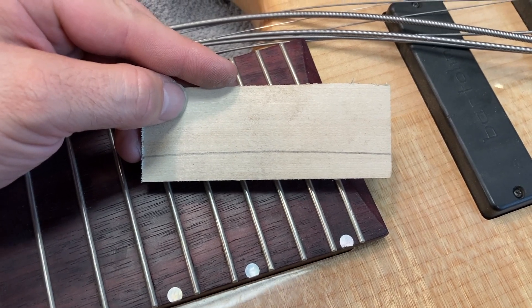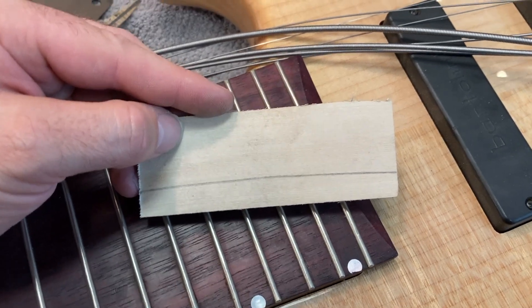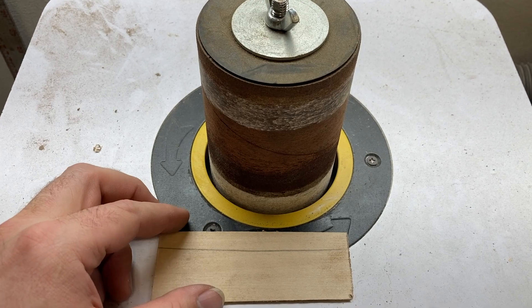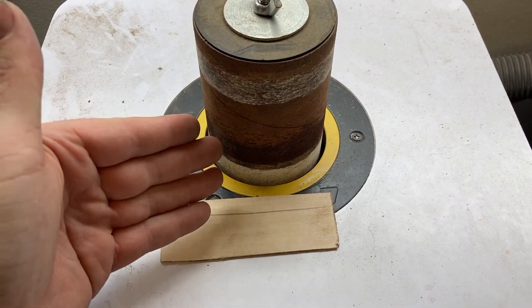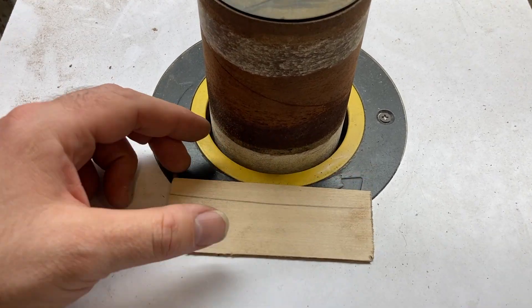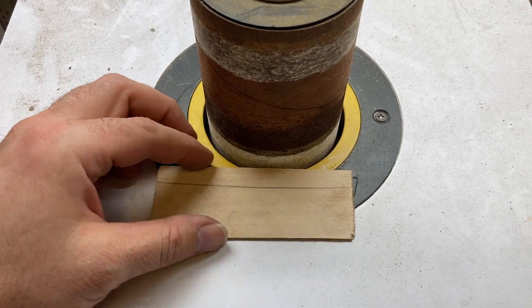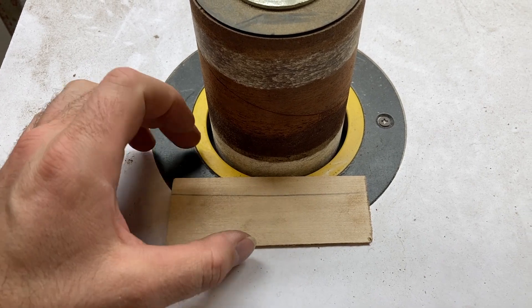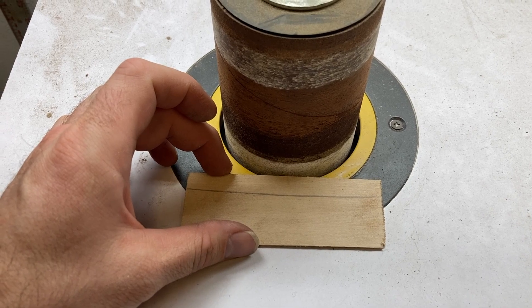And as you can see, that's pretty flat, but it's not totally flat. I'm going to go ahead and show you the tool that I used to actually make this tool. This here is a spindle sander — it's a spindle that has sandpaper on it, and it goes up and down and spins, enabling me to cut curved shapes. I'm going to carefully go right up to that line and try to reproduce this radius using this tool, and then show you how it works.